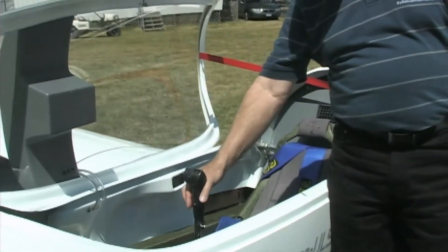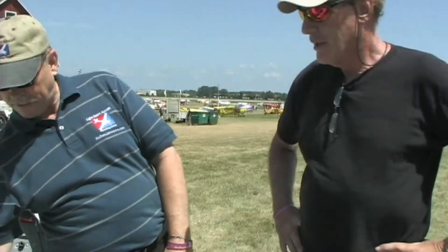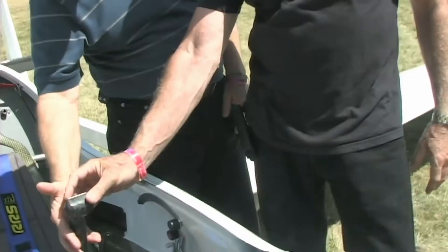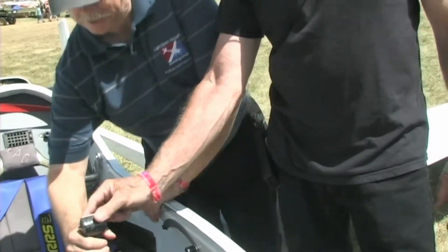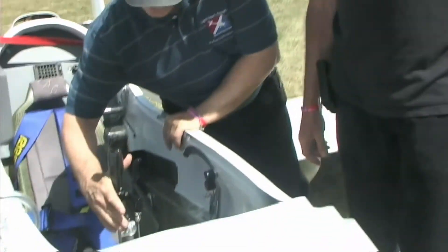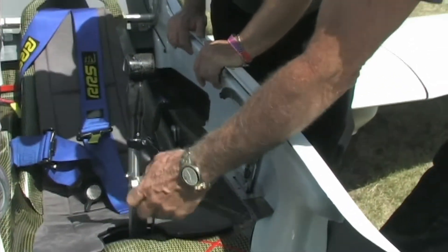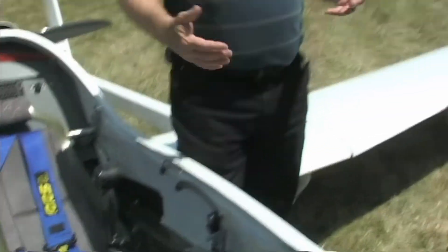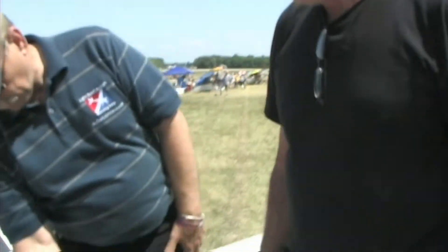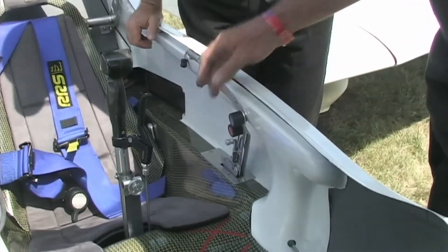Inside we've got a regular joystick with a little knob in the center — that's the throttle. It's a small potentiometer; you just roll your thumb and that's it. Rudder pedals and brakes down below. There's also a trim — a little piece of spring steel. And over here are three knobs: a small one, one marked red, and one marked blue. The red is the flapperon control; there's a small aluminum lock piece — you unlock it, slide it, and you hear the click into detents.